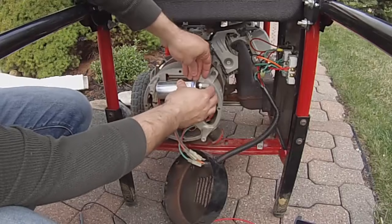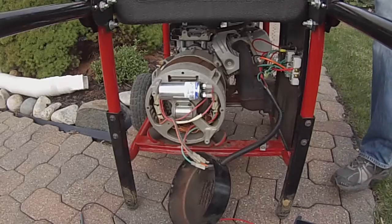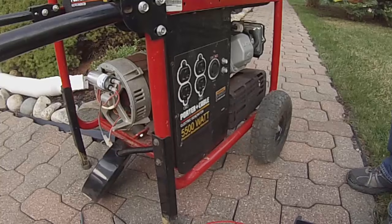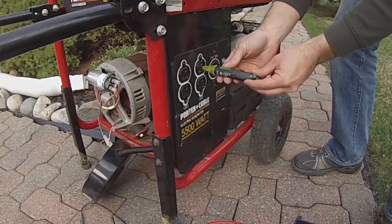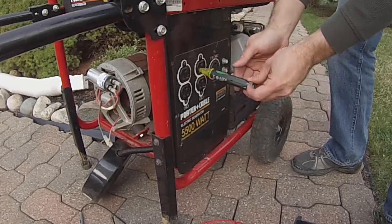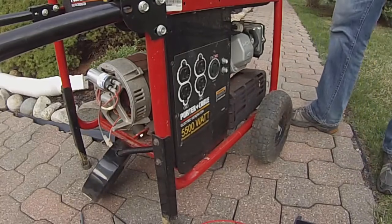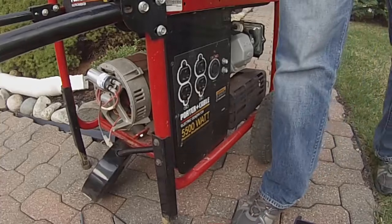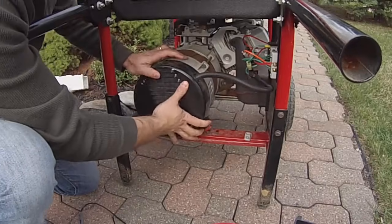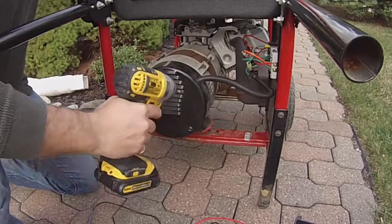It looks like it just fits. Now let's test it. You can't really see it here, but my little voltage tester is chirping and flashing as much as it can — thumbs up. Let's put everything back. This new capacitor is doing its job releasing a charge into the windings to get them excited so the alternator will produce electricity. The previous one was also doing its job when it blew out during my accidental power surge, to protect all the electronics downstream.